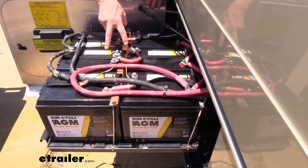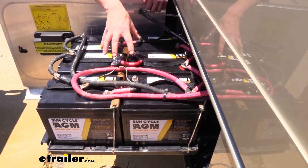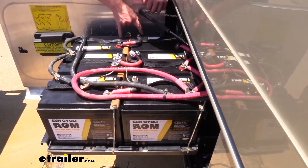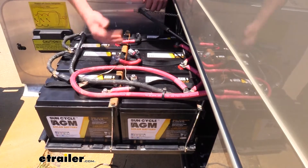If you've got maybe four new batteries but two old ones in here, those old ones are going to drain their capacity sooner than our newer ones and that's going to decrease the life of our newer batteries because they're going to have to be making up the slack from our weaker batteries. It can also affect the way that our batteries are being charged because they're going to charge at different rates as well.